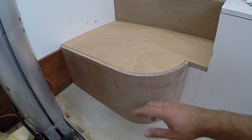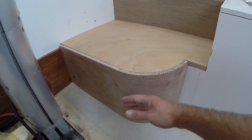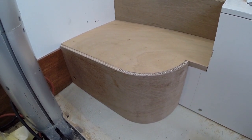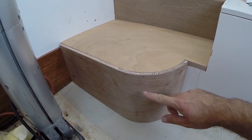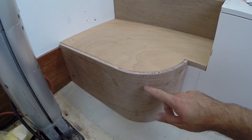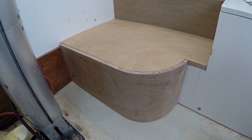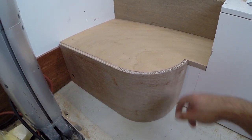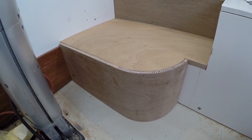For a brief period of time I considered actually varnishing this instead of just painting it, because I thought the grain of the wood here and this curve would look really nice. I did a small test on a piece of scrap of this plywood and sadly the outer veneer of this plywood doesn't even come close to matching the color of the mahogany over there. So I'm just going to stick with painting it, and lesson learned for my next boat — whenever doing something fancy like this, make sure that the outer veneer of the plywood matches the color of the existing trim.